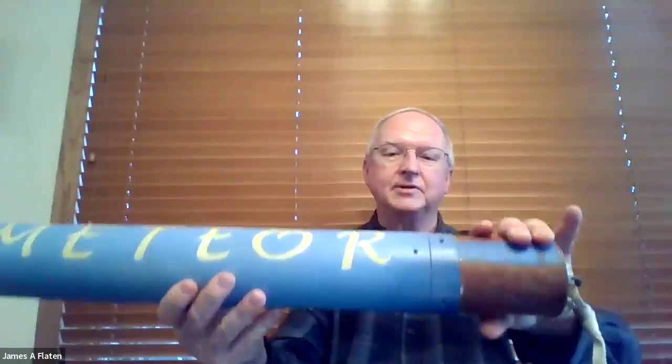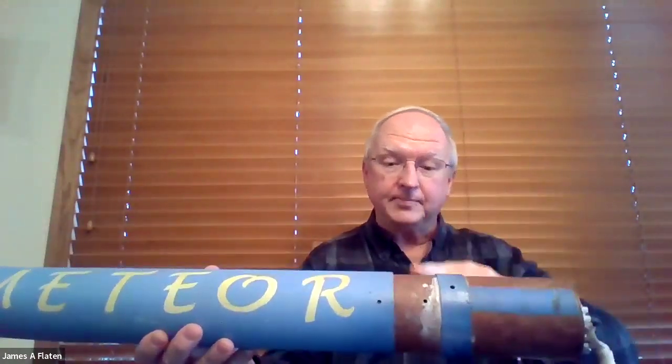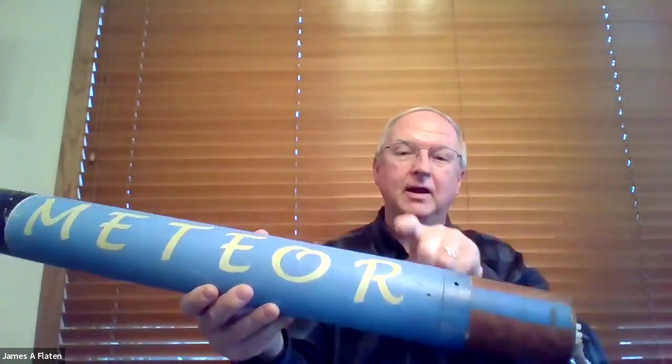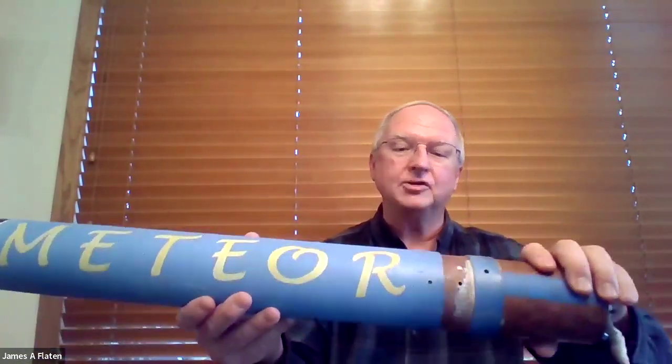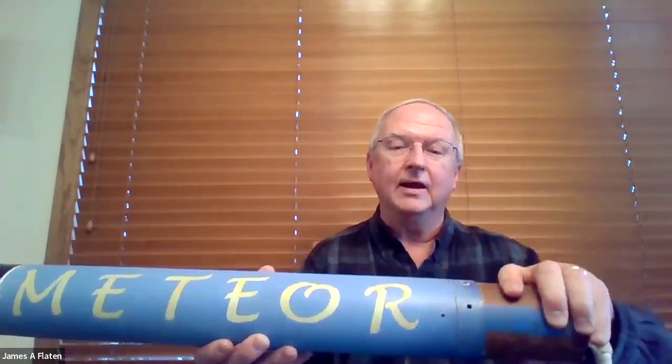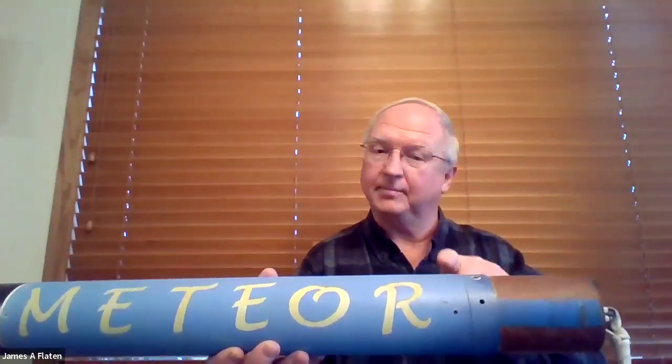I don't want the section right above the collar to come apart ever. The way I'm going to accomplish that is I'm going to rivet these two pieces together. Here's the lower section - I do want that to come off. Here's the upper section. I'm going to take the avionics bay and use rivets to hold it to the upper section. A rivet can be metal, or you can bolt the two together. You could glue them together - don't do that. The reason I don't want you to glue them is I want to be able to take this apart to service the end and put explosive charges on the av bay. Then you assemble the rocket and make sure it doesn't come apart during flight. A rivet is actually a plastic piece that's very strong and won't allow that part of the rocket to come apart even when there are explosions going on.